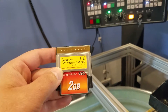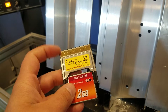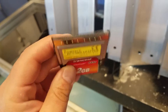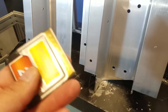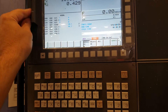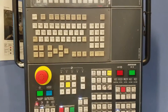This is how you do a backup on a FANUC CNC controller. First you need either a flash card like the big version, or a compact flash with the adapter — we use the adapter. Plug that into the slot all the way. It is not going to feel hard to push in, and if it feels hard you've got it going the wrong way.